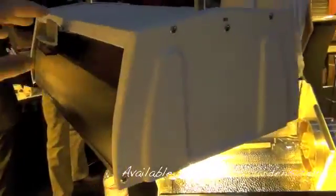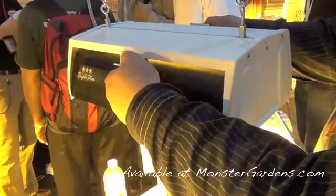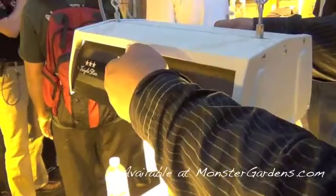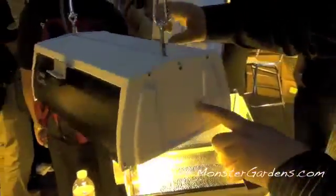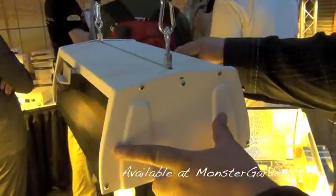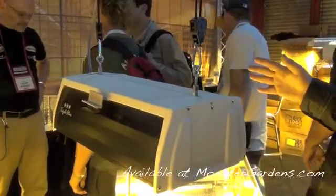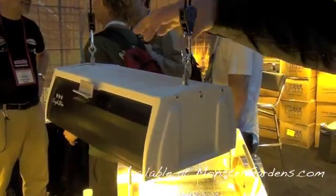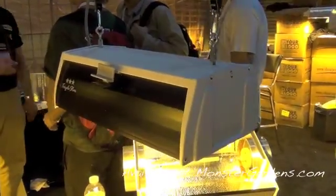How do you adjust the... It's very simple. You push the button and you adjust the reflector. It's free, so you can do free adjustments. There's three adjustments? So this is deep and this is wide. Okay. So you can change it. Also, because you have it on two sides, you can do an asymmetric setting. In the middle, you want it to overlap with the next reflector, but if you have the wall here, you want to stop the light and let it go back in. So this is one of the first reflectors you can actually do an asymmetric setting. Oh, perfect, perfect.